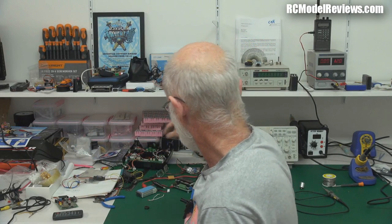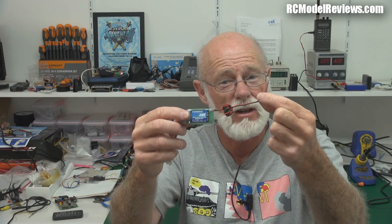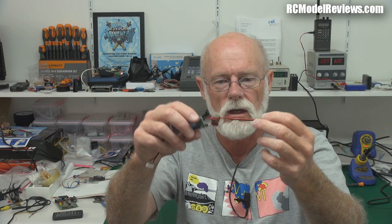Not so handy for low-frequency noise, and I found that because I was going to do a comparison showing you a UBEC with and without a ferrite core. I thought this ferrite core's really got to knock the noise out of a switching BEC. Here's a Hobby King switching BEC — 5-amp switching BEC from Hobby King. I put it on the scope — fair bit of noise coming out of here, about 250 millivolts of noise. And I thought, that's with the toroid on. I took the toroid off — it didn't change, nothing was exactly the same. So because this is switching at about 50 kilohertz, it's a relatively low frequency, and the toroid just makes no difference at all — so it's just extra weight.